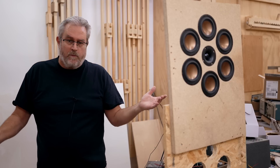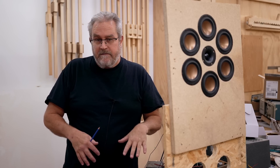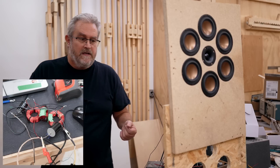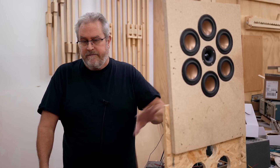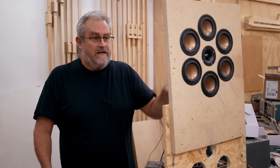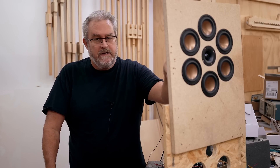I didn't see any off-axis cancellations to the point where you could say this is an unsound design. I should also say this is all very roughly rigged up — the crossover was a best-guess for 1400 Hz with components that were close but not bang on. This is all very rough, preliminary, and rudimentary — you're not seeing anything finished here, even though it looks kind of cool. I used the same crossover with this arrangement here.